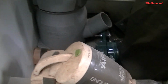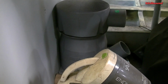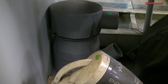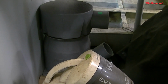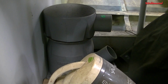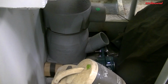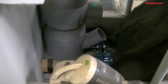Now, I'm looking at the catalogue and specs on this. There's a Vitas part. It's a 150mm diameter exhaust, and looking at that, they do offer mounts, rubberized mounts to stop vibration as an extra if you want them. And believe it or not, I actually have some that came out of something else. They're in really good condition. I'll just give them a little tidy up, and I think I will mount them on those. All told, I think that thing can weigh about 60 odd kg when it's full of exhaust at its heaviest, and these are rated at 140 per unit, so it'll just take the vibration out of them. So I'm going to start making up those mounts.